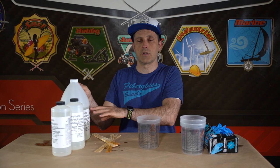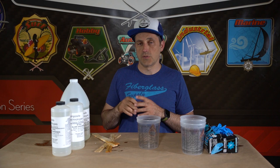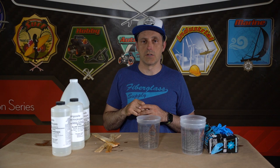Some systems the hardener has a different ratio but can be used with the same resin — so many hardeners, same resin, and they may have different ratios. West System epoxies are like that. By weight is often different, so you need to check the bottle or the data sheet to make sure what that ratio is by weight. In this case we're using a two-to-one — it's simple and easy to do the math. You need twice as much resin as hardener, or half as much hardener as you have resin.